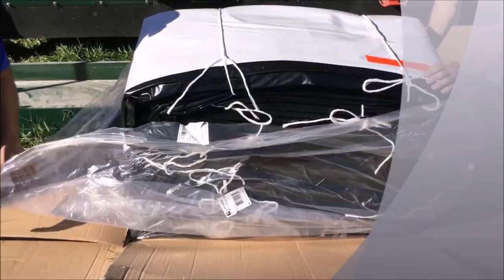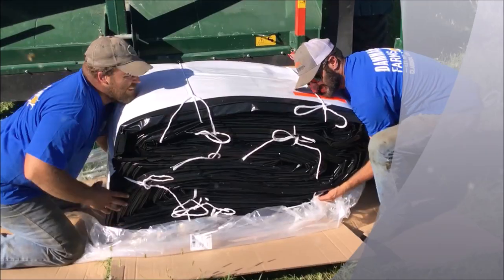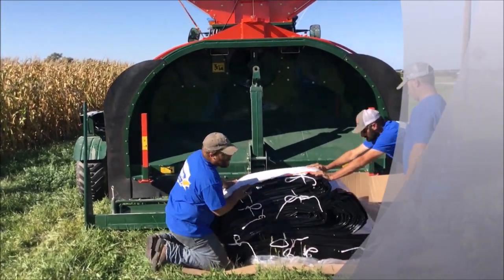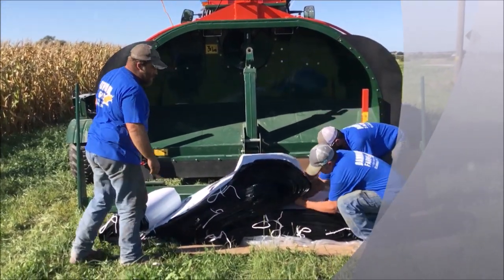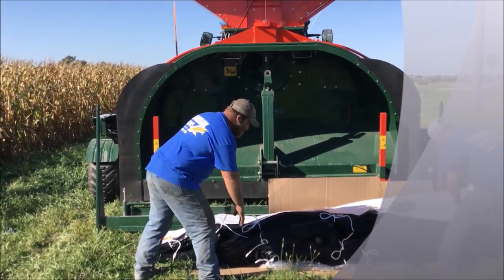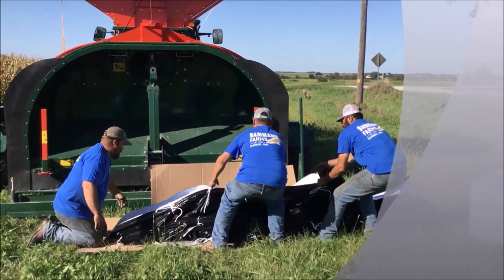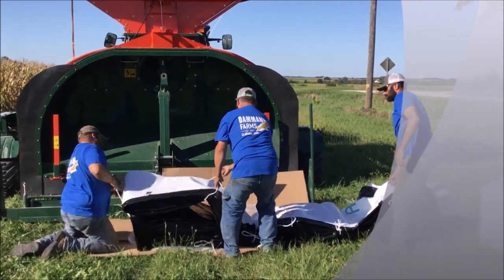On the top of each bag there's a sticker with tape indicating your stretch. The stretch mark on the bag when it comes out is exactly 11 inches. The max stretch — not the goal, but the max — is 12 inches. We're going to show later in the video how we can do a couple other things besides measuring stretch marks to give adequate stretch and see this from the grain cart. They're now stretching that bag out, pulling those folds out, getting ready for the cradle to lift the bag onto the machine.